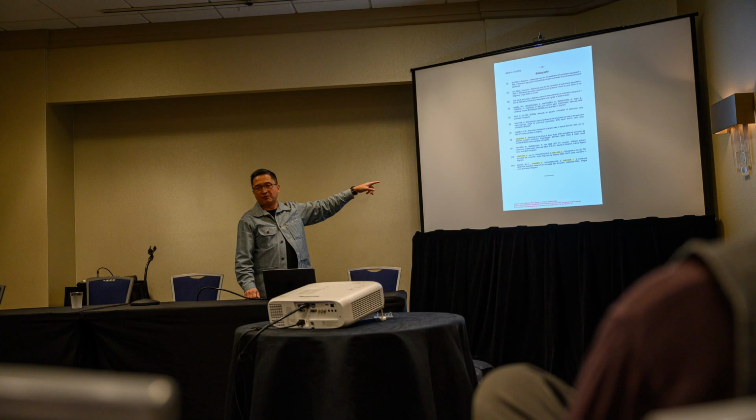But the Zwislocki coupler was difficult because it had 4 branches and the use of something called felt metal, which I'm not even familiar with the material, to produce resistance. A more stable design was in demand. The 2-branch design in the ANSI standard was simpler in design, but used compressed cloth to realize resistance, which was not very stable. In the IEC, work was also going on specifying an occluded ear simulator in addition to the simple 2cc coupler. And in the IEC, the target curve from ANSI S3.25 was more or less adopted, however, with different tolerances.